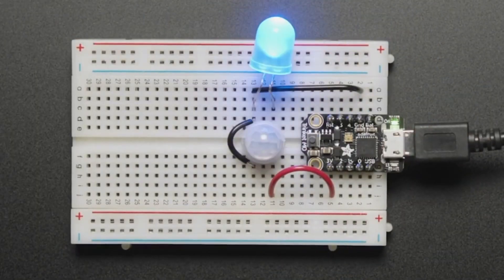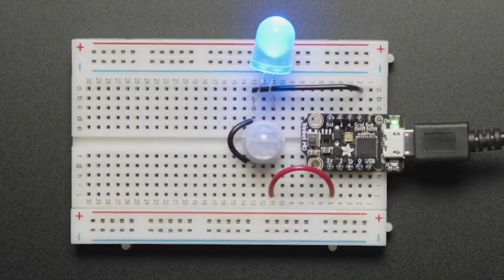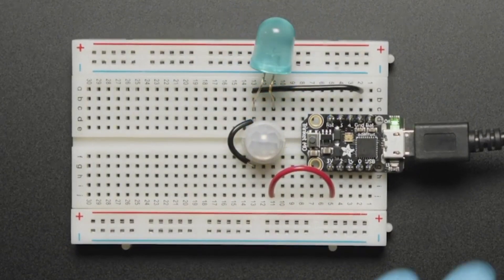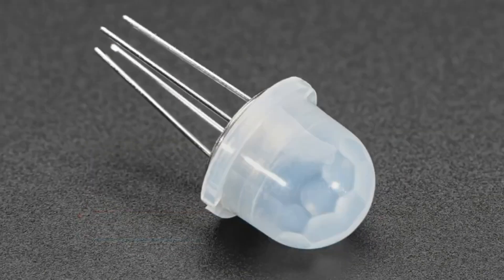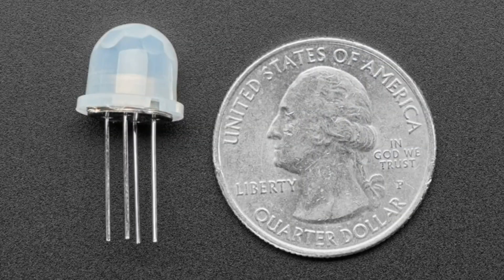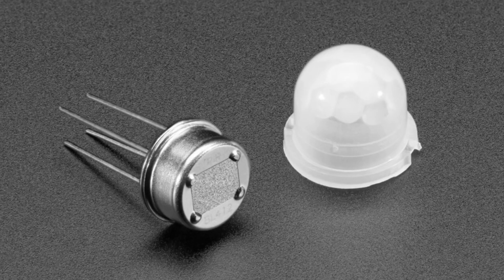I decided to carry both. What's neat is you only need power and ground, and then a third pin controls on-time — how long the output stays high. In this case I've just grounded it, and then an output pin goes high when it detects something. That's it — no additional circuitry required. It runs off of three volts, so just make sure you're pairing it with three-volt logic. They're really simple, really inexpensive, and really small. They don't have the range and flexibility of larger modules, but you just give it power and ground, signal comes out, and that's it. For most projects this is great, and then if you need to upgrade to a larger PIR sensor, you can.